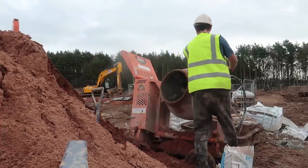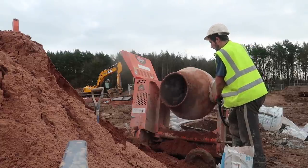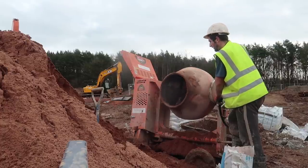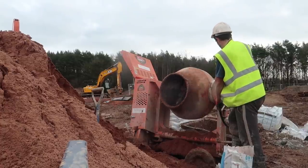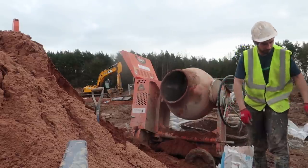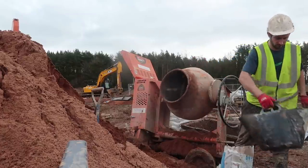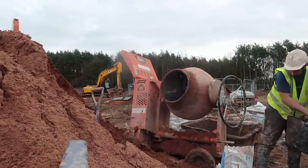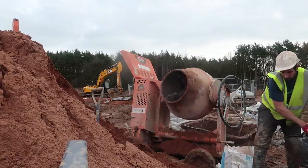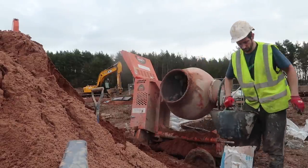More sand, and here's a tip on the mixer settings — I lowered it so it's more horizontal, more shallow, so the blades mix the cement up better. The lower the mixer, the more the blades are working. As you go up toward 90 degrees they're hardly working at all, because it's just spinning in a circle. You've got to let gravity do the work with the mix.